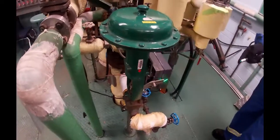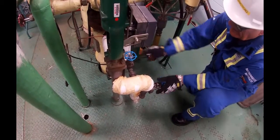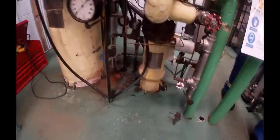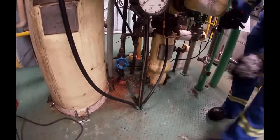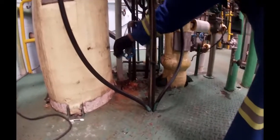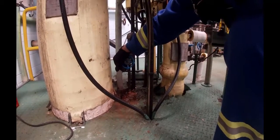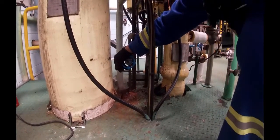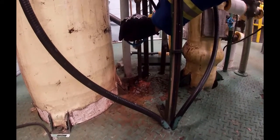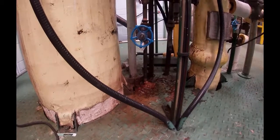Is my control valve. And this valve is right now 30% open. I'm going to open up this hand valve. The bypass is closed. And I can hear gurgling happening over the other side over there. So we're going to go back and watch that. Now I push the air out. See it puffing? Got to get all the air out of that heat exchanger. I'm going to go back. Actually, yeah, I'm going to go back to the panel and open the valve up a little bit. I'll be right back.